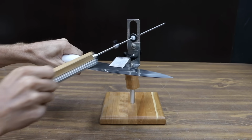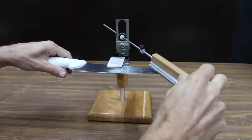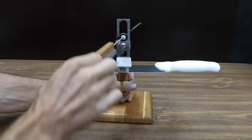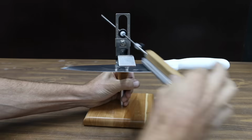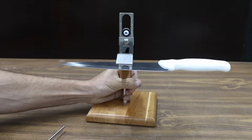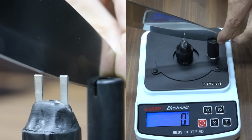Step 1: start by working a stone forwards and backwards on the blade to shape the cutting edge. Step 2 is to finish each stone with a series of upwards into the edge strokes, rotating the blade frequently to remove any burrs. You can work from tip of the blade to the heel or vice versa. Try to sweep the stone along the length of the blade as you move the stone upward and into the cutting edge. The fine and the extra fine stones can only polish and refine the edge. The KME did an amazing job reshaping the bevel and it looks razor sharp.